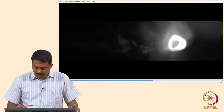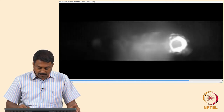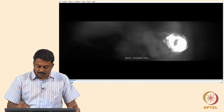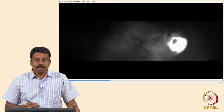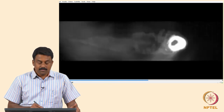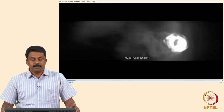The illuminated region is about 5 mm, and the melt pool can extend up to 15 to 20 mm. The molten pool always takes the shape of a teardrop due to the severe temperature gradient prevailing during welding. This is the molten region in the pool. When this structure solidifies, you will have columnar growth happening from the fusion boundary, and the melt pool boundary can be seen clearly here.